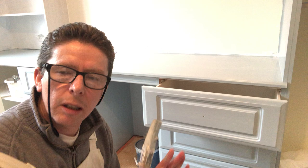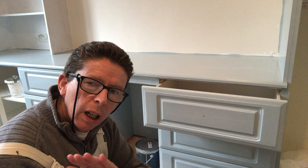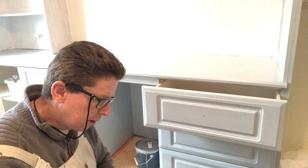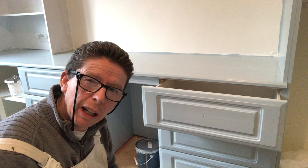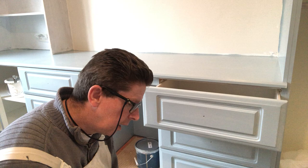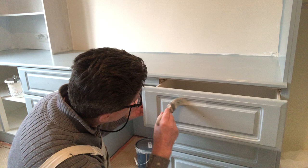So if you want to do this yourself — remember, this is oak furniture and you want to paint it in a ColourTrend colour. Wipe it all down, de-grease it, then sand it down. You don't need to go mad — get a wee sanding pad, maybe 240 or 180 grade, just get a wee sand so the primer can grip to it. Two coats of ColourTrend Prime Two, then three coats of finish. If you do the job right, you're sitting with a brand new piece of furniture. If it's done properly.